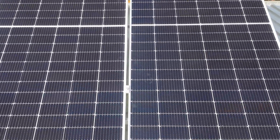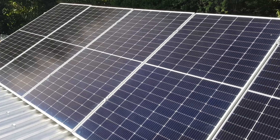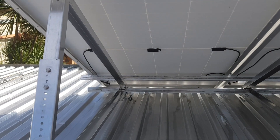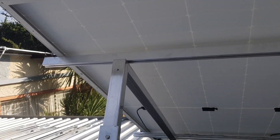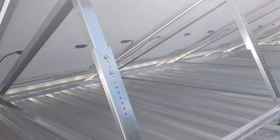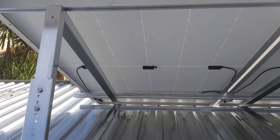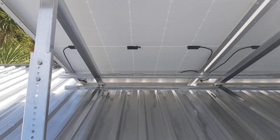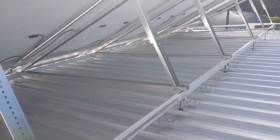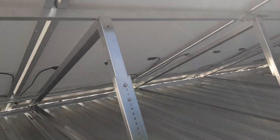Now we're going to tighten down the bolts, first aligning the panels as we go along. It's got a nice straight line, and as you can see they are overlapping this bracketing system by about 400 millimetres — 40 centimetres. I think that's the maximum overhang people should put on these bracketing systems in length, though if you put them in landscape orientation then it's a different story.